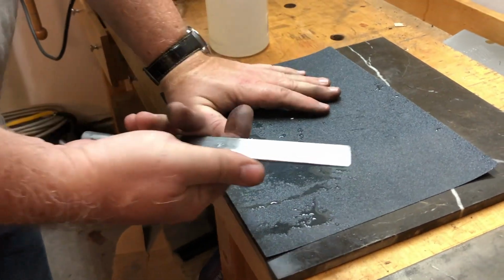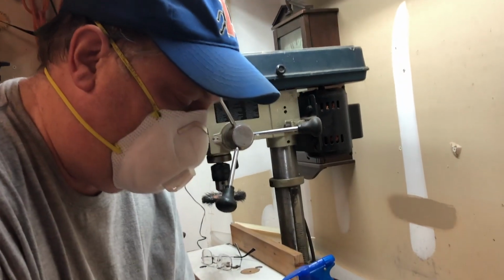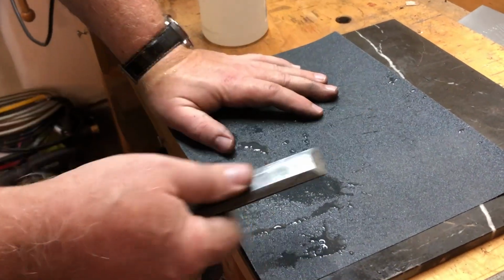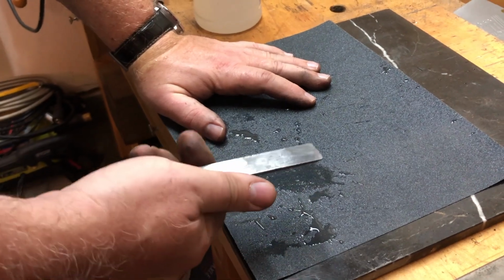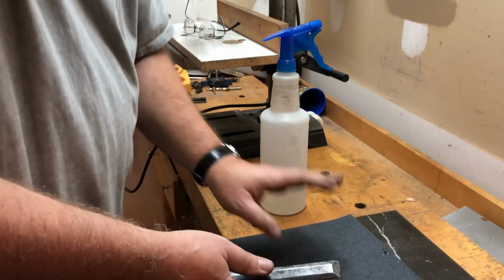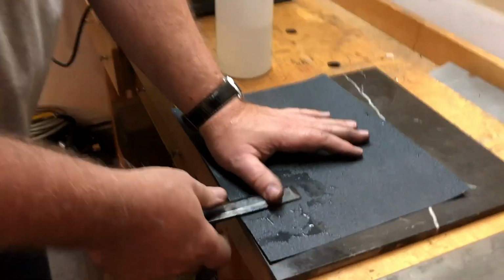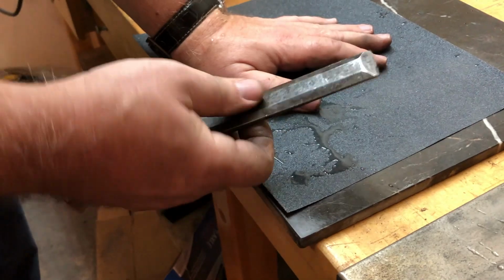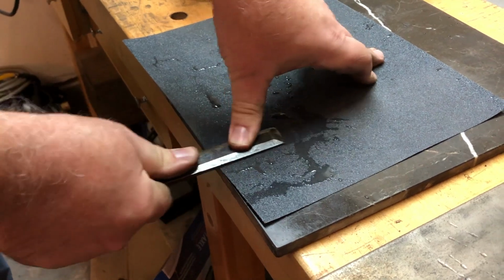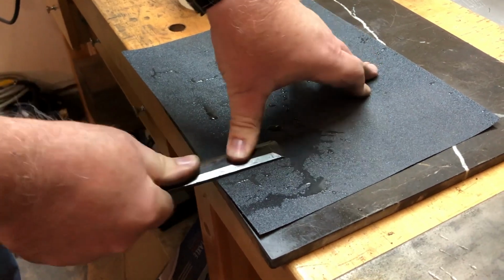Back in the day, a lot of these were just carpentry chisels, and they didn't have to have a really fine-tuned back like this. If they could get a sharp bevel on the edge, that's all they were going for. But today we found out that if you do lap the back, get it nice and flat, and get a much sharper edge, it'll stay sharper longer, and you can use it for finer work. And the steel in these things is fantastic. They'll take an edge and hold an edge forever. My favorite chisels are these old chisels because they have really good steel in them.